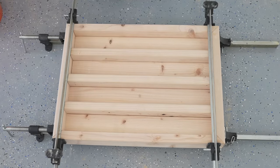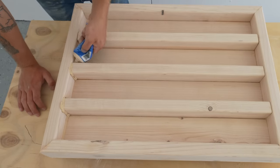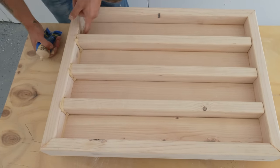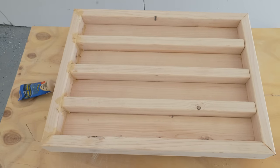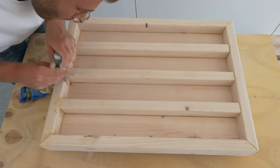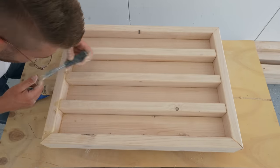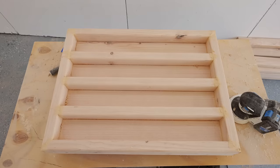I'm curious to see how these boards react and what this sofa looks like in a couple of years. Remember, if there are any problems I can always come back and fix them — that's the benefit of making stuff. Anywhere I used wood filler between my joints I used a chisel to clean up before it dried, which gave me a lot less sanding to do later on.